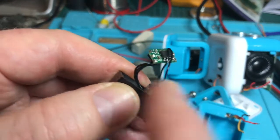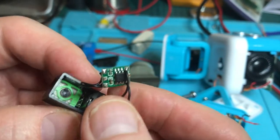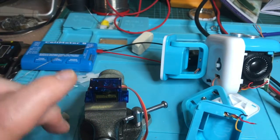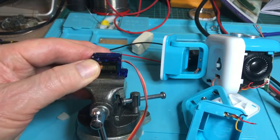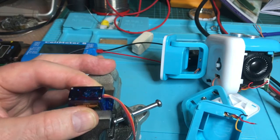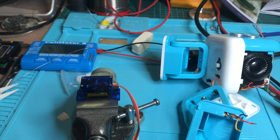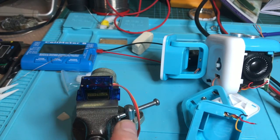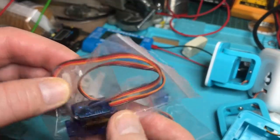There is a good thing about this — you get a lovely little motor and a PWM control chip, even though the main cog is destroyed. Actually this is a different make because the other ones just had two screws on them, so I'm not going to use this even though it's the same model — it's not from the same batch. The reason is that a lot of these things are manufactured all together and there are small variations in them. This one came from a different manufacturer because it's got four screws whereas the other one only had two. So I actually want to stay consistent. I've got two more bagged servos and these are the two-screw types.